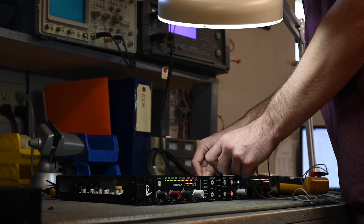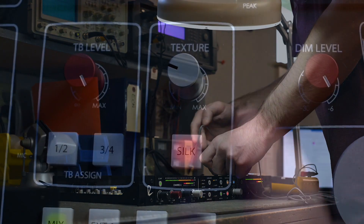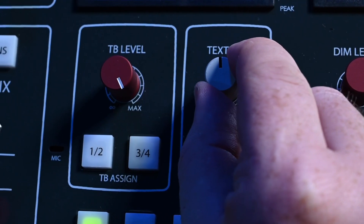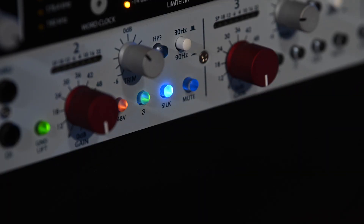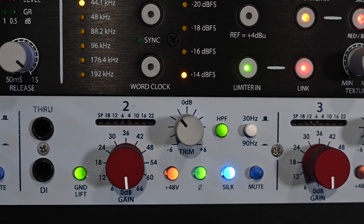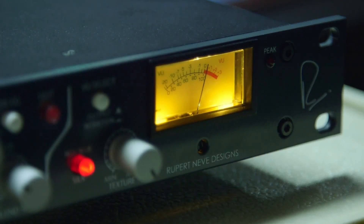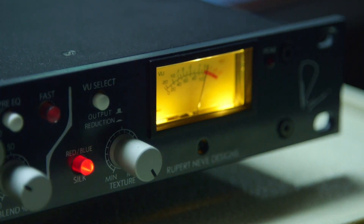To take that a step further, by taking the feedback parameters of the transformer and filtering out some of the feedback, you can bring the transformer back to a vintage style where the inherent characteristics of third and second harmonic distortion are allowed to come back out. Silk has been developed and enhanced over a number of products and development cycles, all having the same basic fundamental characteristic of allowing second and third harmonic content to come out.